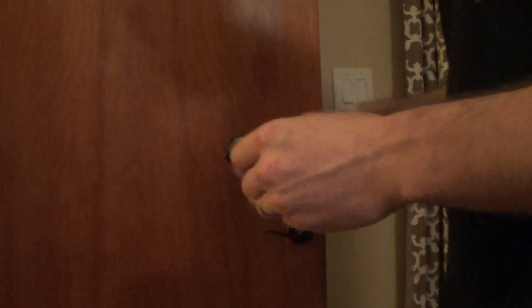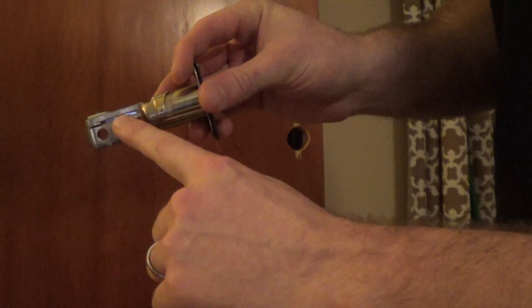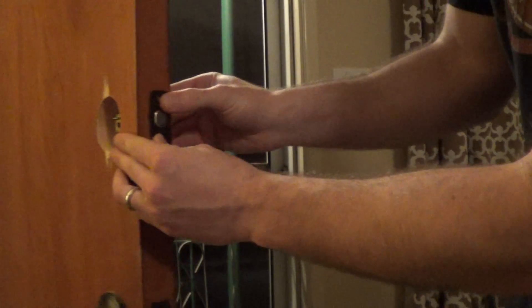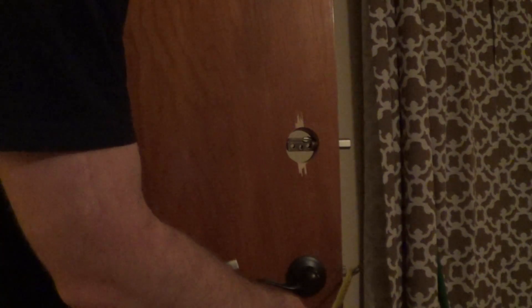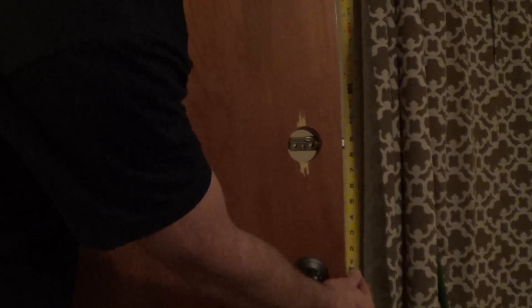The next step after we drill our hole is to go ahead and put the bolt in the slot, and you can see that there's an 'up' marked here. The very first time I ever installed one of these, I put it upside down and it took me literally about a half an hour to figure it out, so definitely make sure it's oriented up — it's essential to this thing working. What I'm going to do is install this by drilling two holes in, then chisel it out so it's flush. So you see I have my deadbolt intact and flush with the door. I'm going to take the center point, choose the lower handle as a point of reference, measure from the center of the lower handle to the center of the deadbolt — and I'm right at about eight and a quarter.